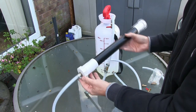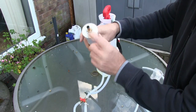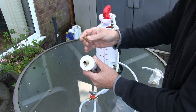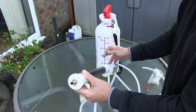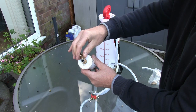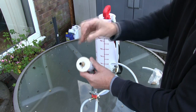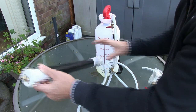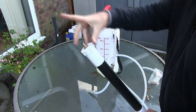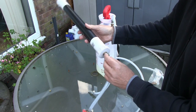All the gun is, is really identical on both sides. You've got one of these 3/8 by 10mm barbs which goes in either side. Drill a 15mm hole, heat it up with a blowtorch, and then just screw that in carefully with some silicone adhesive on the end to glue it into place — same on both sides. One of these acts as a nozzle for the foam to come out of, and the other one is where this mixing tube fits into.